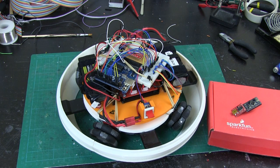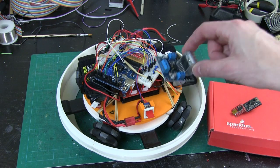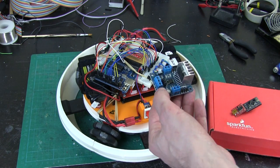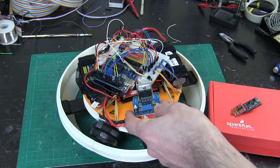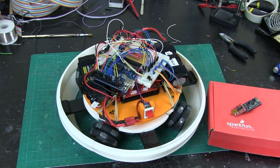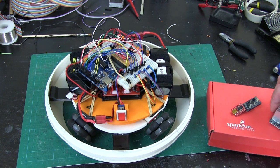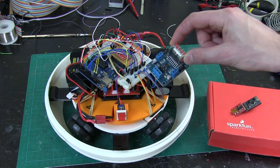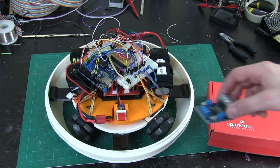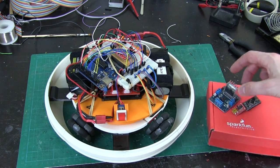To do that I'm going to switch out the motor controller for an L298, which is a standard dual H-bridge part. You can buy these at SparkFun Electronics — it's a standard part that's been around for years, but it does need two PWM channels for each motor. That means I can't run the motors independently, so the plan to spin the head by running them all in the same direction won't work without two L298s and an Arduino Mega. For now I'm just going to use one and lock the X and Y axes together so they both turn in the same direction.